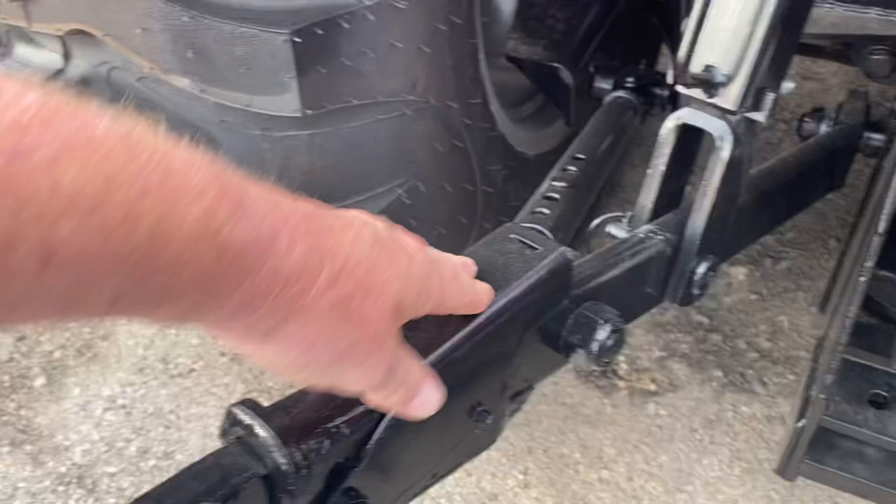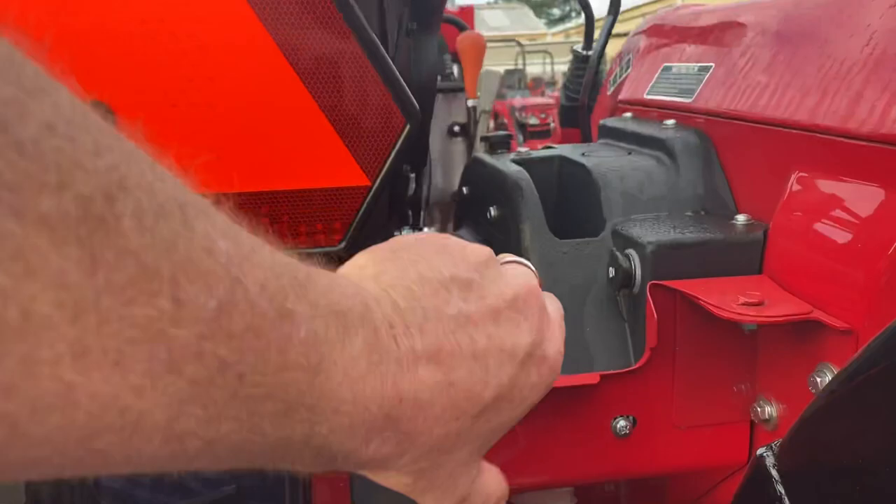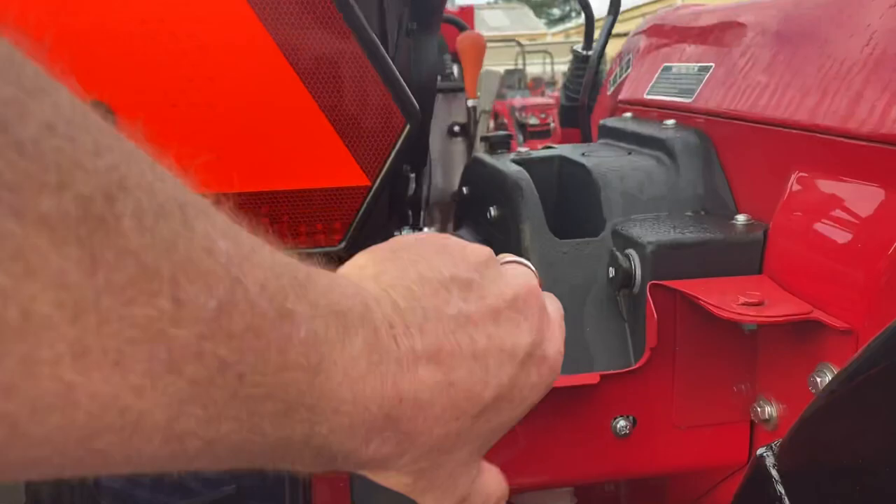Here's your top link — Cat 2 and Cat 1 hookups on both of these. Telescopic 3-point arms. Your draw bar is a little different now — more beefed up, a little more safety. One extra remote in the rear. Bell hookup for a trailer or lights. Cast iron rear end. Rear work light. And that's where the MCRD comes in — the major common rail diesel system. That's Bosch injectors.